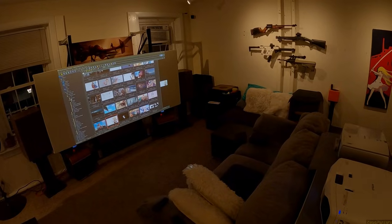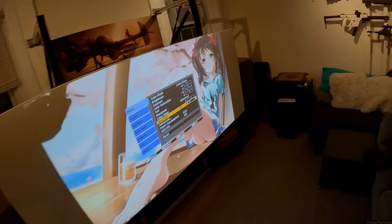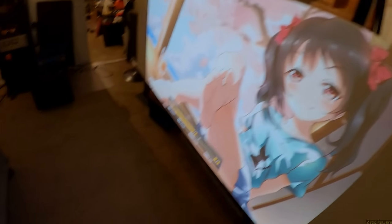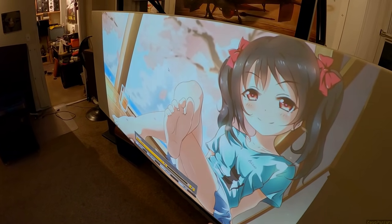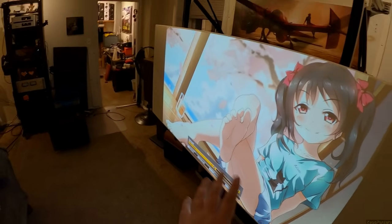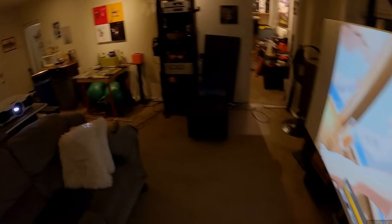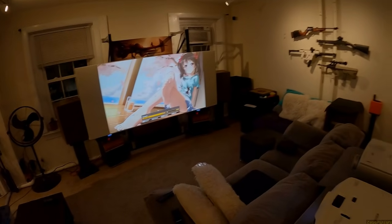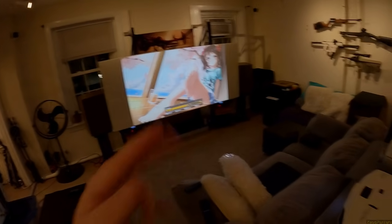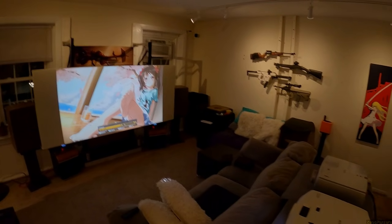Color temperature: my old projector listed actual Kelvin values from about 5,000K to 8,000K in 500-increment steps. This more expensive unit just shows numbers with no Kelvin translation - lower is redder, higher is bluer, I have it on two. They dumbed that down and it bothers me. On skin tone: going lower makes things redder, going up to six makes everything green - and it affects all the reds, making them look purple. Calibration is a passion of mine - I may not be formally trained, but I obsess over it. I have a Sony GDM-FW900 CRT monitor right there, so don't talk to me about picture quality obsession.